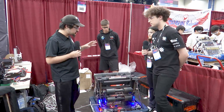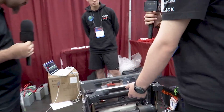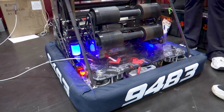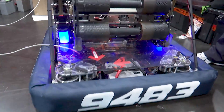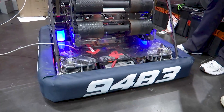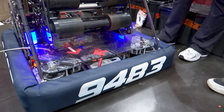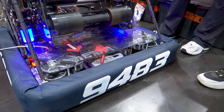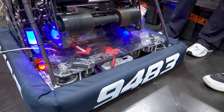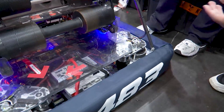August, talk to me about your chassis — it seems like you're doing something special. So we use an SDS MK2 inverted swerve chassis, and then we have a bellypan. The reason we use a bellypan is we're trying to center the weight on the robot to make it as close to the ground as possible — to avoid tipping or jamming any note under the robot. We center our electrical board and the PDH in the center to avoid any collision while being contacted by other robots.